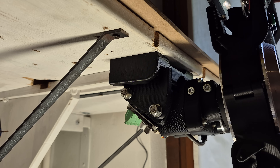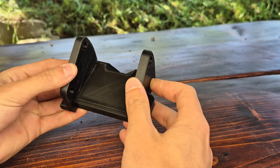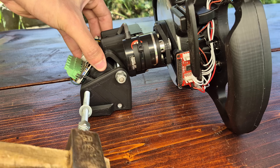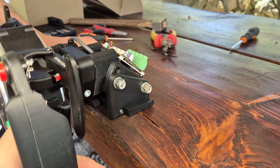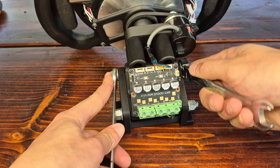The last thing on the list is to assemble the quick release base. An 8 millimeter threaded rod can be cut to 8.5 centimeters and used to align three components. This U-shaped structure holds the main assembly using two further lengths of threaded rod, giving the ability to swivel the steering wheel up and down to find the perfect angle, after which the nuts can be tightened to secure everything in place.